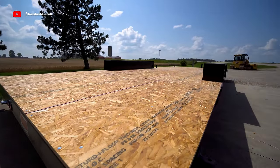Then I'd just nail in this siding shroud that came with the receptacle, and this just replaces the J-trim I'd have to put around it otherwise. And then I can just use some house wrap tape to tape up the sides and then overlap that flap of house wrap back over top and tape it down.